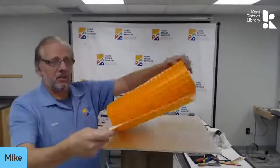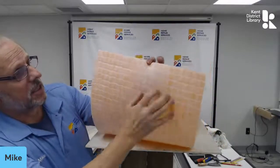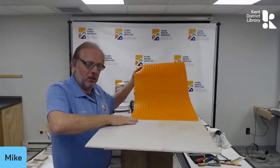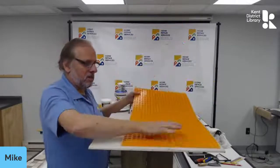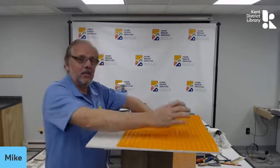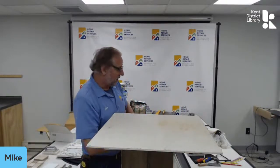There's another type of subsurface you can put down — it's got a fiber on the backside and a partial honeycomb shape. You would cover this whole thing with the proper adhesive and stick it right in. After that dries, you cover this whole thing again and then you can start putting your tiles on. It makes a very solid surface — what I call a user-friendly, install-friendly kind of product.